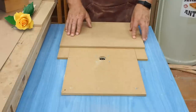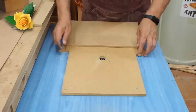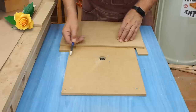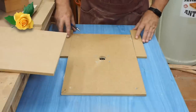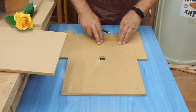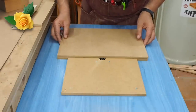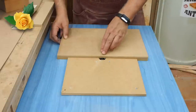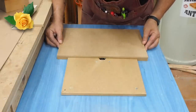To make our circle-cutting guide for the milling table, the first thing we've done is draw a line here perfectly square with the sides, passing exactly through the center of the router bit. It has to pass through the center and be square. We've cut these two pieces from the same material so they have the same height, and we'll place this one on top. This piece has to reach exactly to the center — going past is fine, but it's better if it reaches the center. And now we'll glue this here.